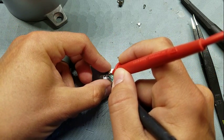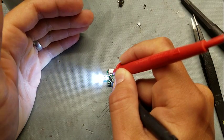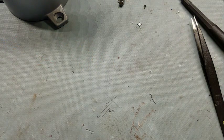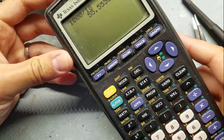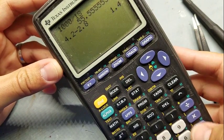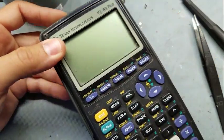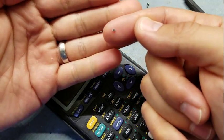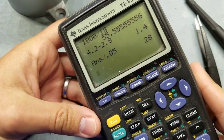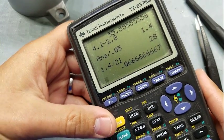I think a good current for LEDs like this is 50 milliamps — a good amount of light for a light like this. I've set my power supply to limit at 50 just to measure the VF, and that is 2.8 volts at 50 milliamps. The voltage drop would be 1.4 volts, so I need a 28 ohm resistor to limit that to 50 milliamps. I found a 21 ohm resistor, which will have to be close enough — that gives us 1.4 over 21, which is 66 milliamps max.